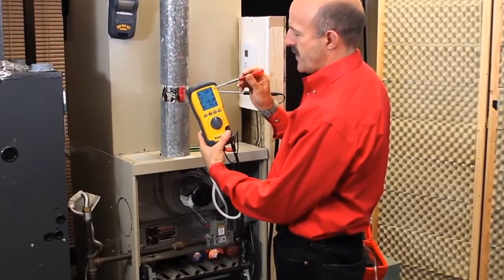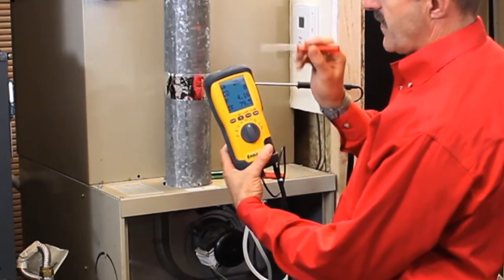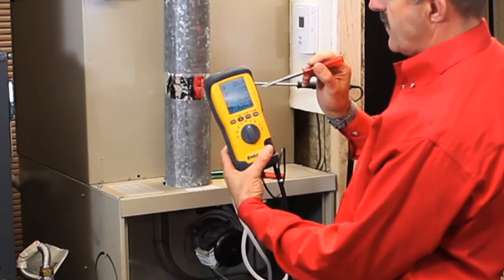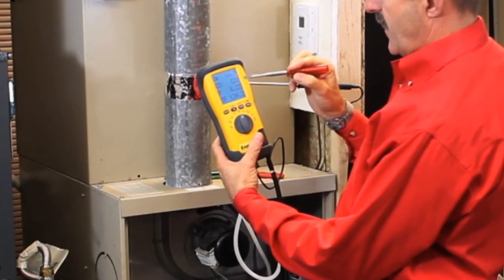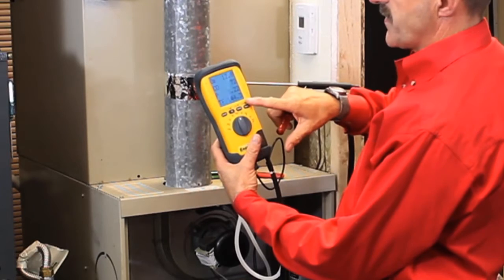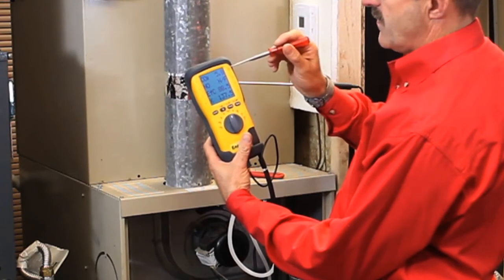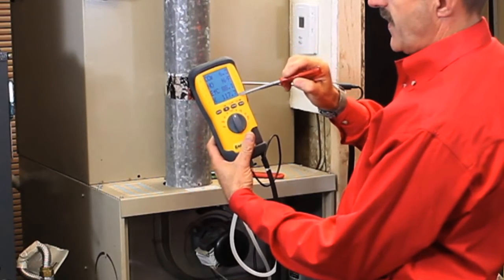What we have on the screen is O2, CO, gas pressure, and flue temperature. You'll see the unit just fired up and the CO starts to rise and O2 starts to drop. The screen has eight parameters total. Press and hold F and it says flue page 2 — now you'll see CO2. It can be upgraded to have NOx, combustion efficiency, and excess air.